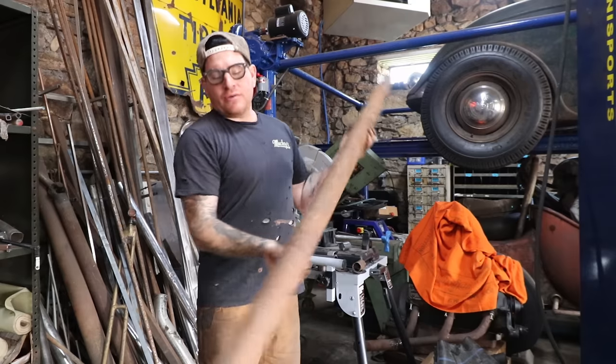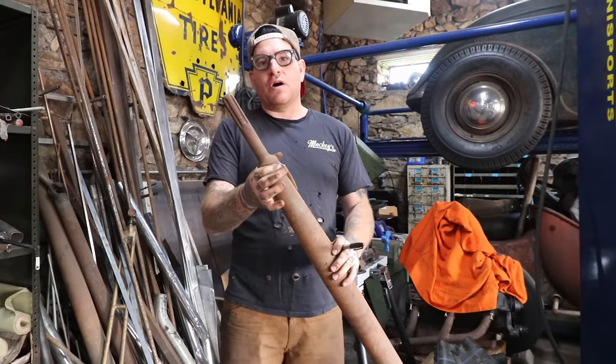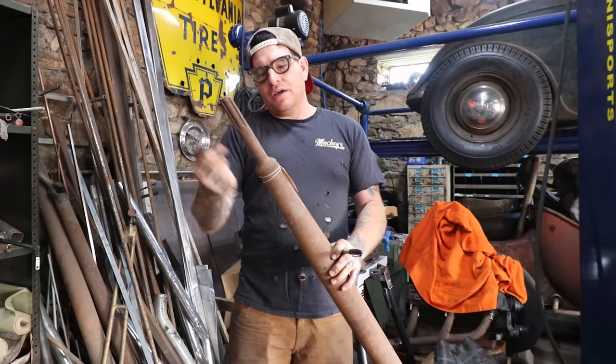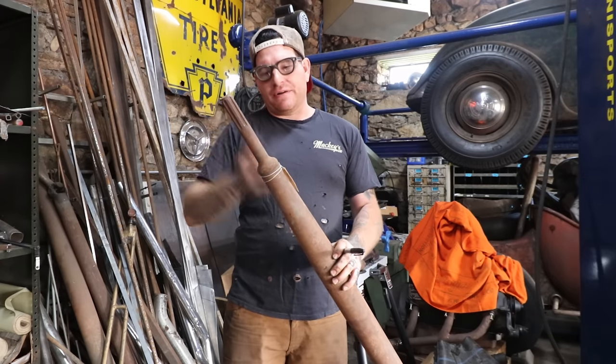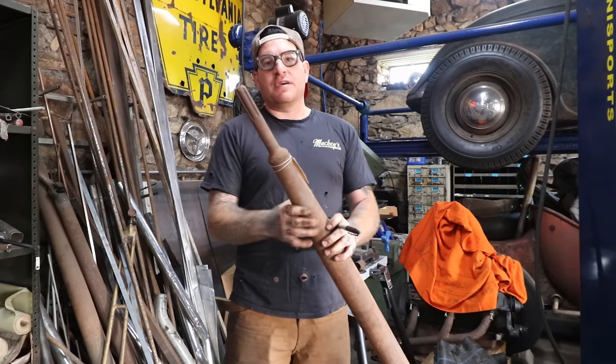The other end, we will chop off right behind the weld, because we want it as small as possible, because we're gonna slip our tube for our headers right into it. You have to put some relief cuts, squeeze it together, and then weld them up and blend all of them out to get it to fit nice and tight, but that's basically the process.